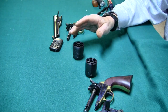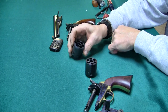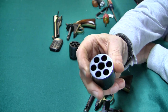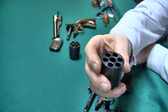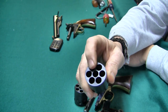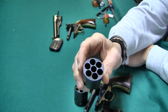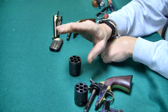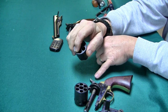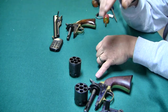To make a long story short, one guy said it's sloppy reloading, but then he found something else. If there is a sharp edge — and this is a manufacturing thing — if you look at this cylinder and run your finger, you can see the edges have a chamfer or a bevel on them on the newer gun. On the older gun, there is no chamfer or bevel. I went and looked at all the other guns and this edge is broken on the mouth of those chambers — and I've never had that problem with those. This one is sharp as a razor. What happens is, when you're ramming the bullet down and it's going in kind of cockeyed, the sharp edge is shaving off a hunk of lead that's disproportionate, leaving a gap to where a spark can go around the ball in the chamber and set it off.